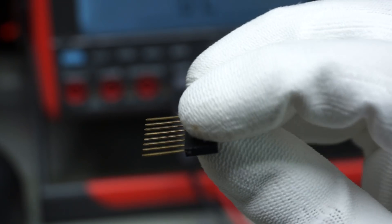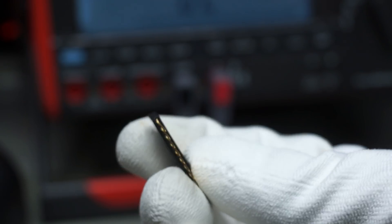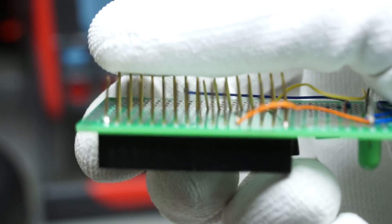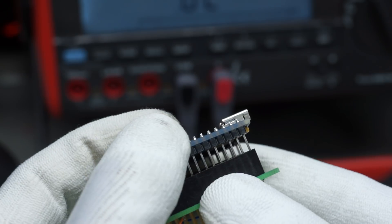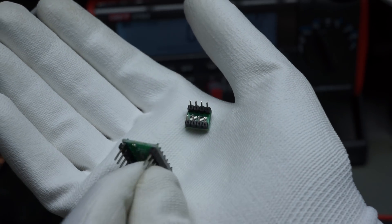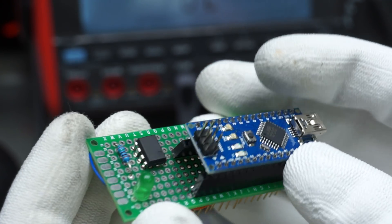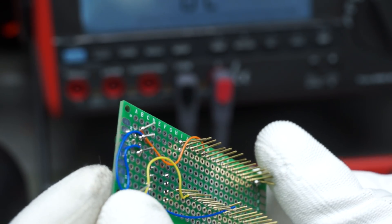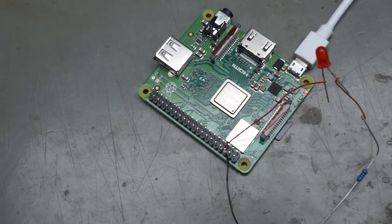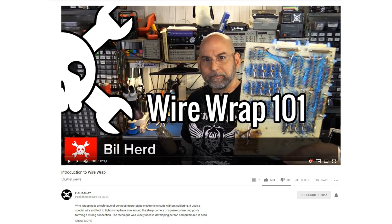But there are a few additional tricks I can show to you. For example, these pin headers which come with the D1 mini boards are ideal, because you can connect many wires to one pin. You just solder the two opposite pins to your prototype board to keep them in place. Now you can plug in modules or through-hole components. You even can use SMD parts if you use these PCBs. Or you can solder a transistor or a voltage regulator on the board and use the excess length of the pins to wrap wires to it. Or for quick and dirty hacks, you wrap the parts together on the fly. If you want to know more, I leave a link to a video of Bill Hurd in the description. He shows boards from long time ago and also some automatic tools which were used back then.